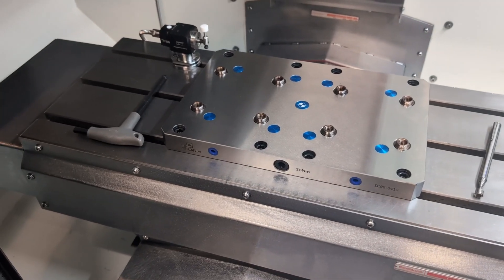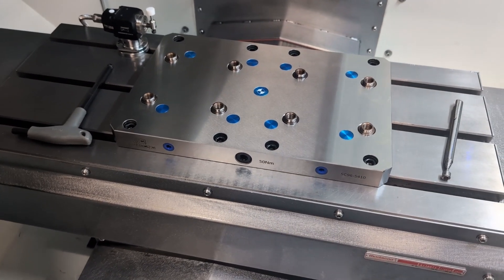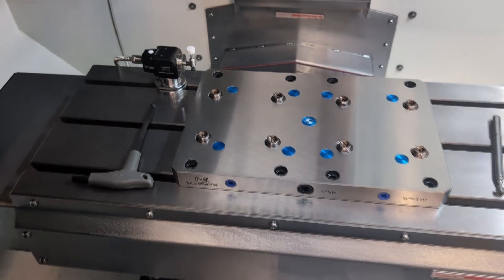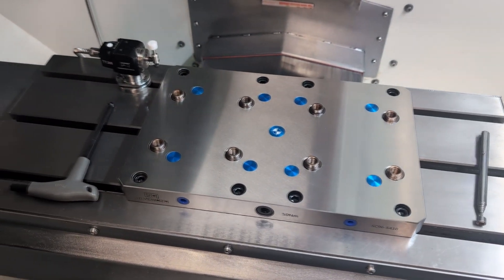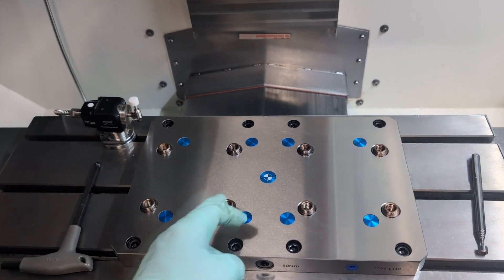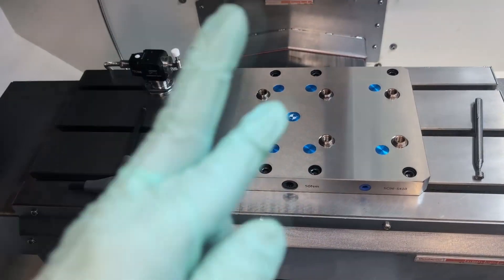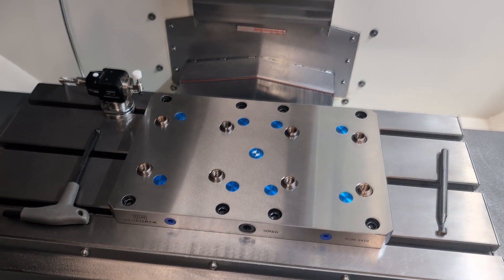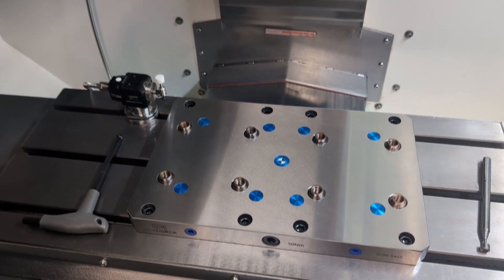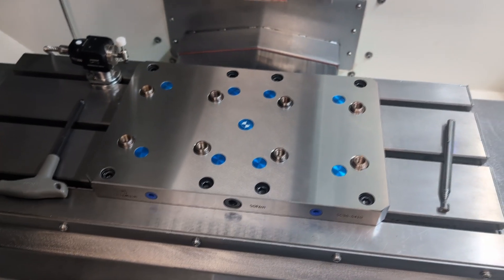You guys all know how to tram in a vise — that's my plan here. I'm going to tram this in X and double-check in Y. I'm going to loosely fit this in here, then throw in the vise that I bought from SilverCNC, and then sweep the vise and see how it compares when I sweep it in X here. The way things are going tonight, it should line up perfectly well. I wouldn't want to have to change the tram with each setup — that's the whole point. So it should work out well.